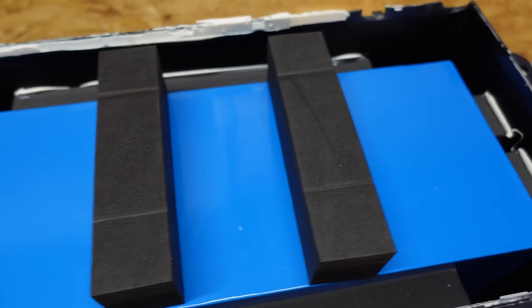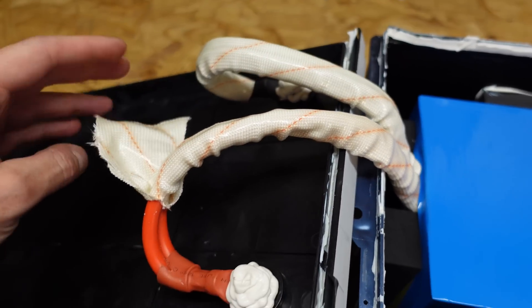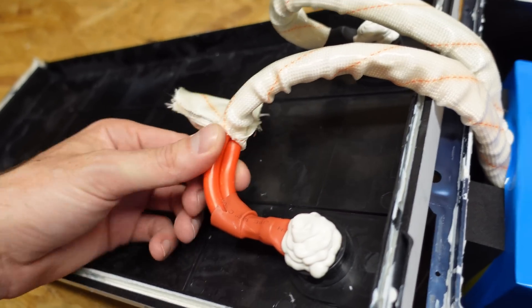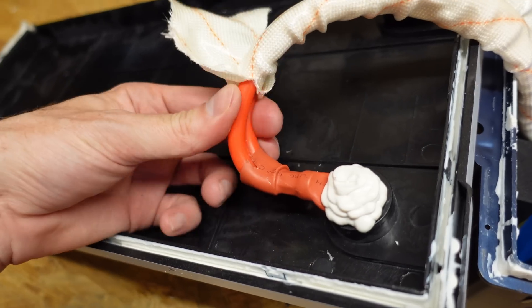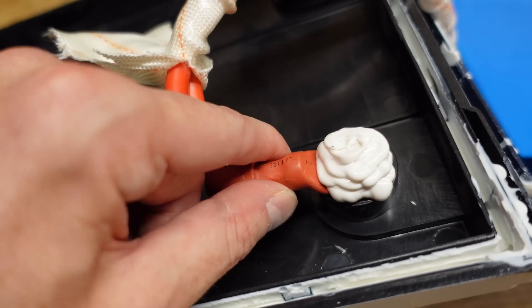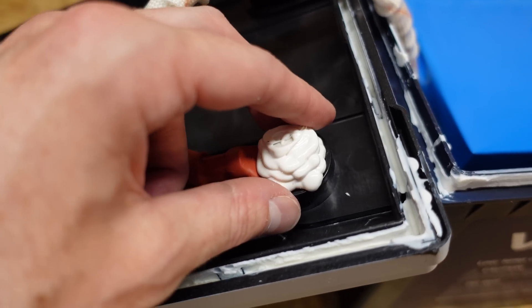There's our battery pack down in there. We've got a wire with heat protective wrap around it. I cut this back a little bit and there are a pair of conductors in each one — these are six gauge silicone insulated wires. We have a pair of number sixes and they go out to a lug here which is crimped on and then bolted to the inside of the terminal.